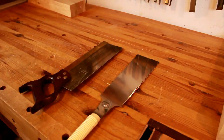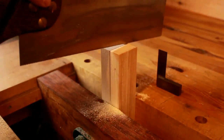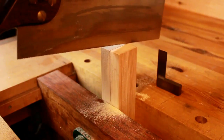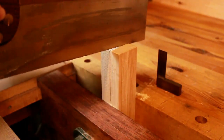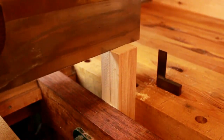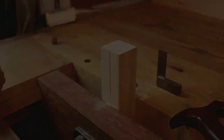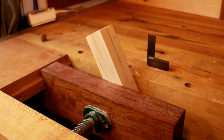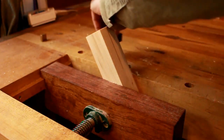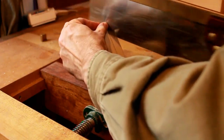Now let's look at how to cut a thicker piece of wood. I'm going to use a Japanese ryoba nokagiri and a tenon saw backed with brass. Cutting thicker wood is a little different because you want to make sure your line is straight on both sides as you cut. Angle the saw and then start to lower the handle to get that first cut really straight on top. I'll tilt the piece at an angle in the vise so it's easier to follow both the line on top and the line going down the front. I put a square next to the piece of wood to keep my saw straight and perpendicular, then gradually lower the handle and cut down at an angle.